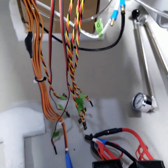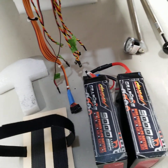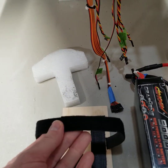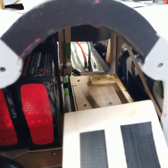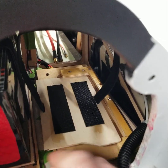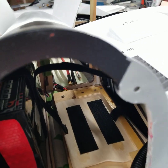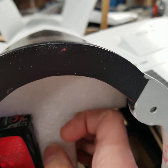In the tray system — a simple tray, aircraft-grade ply once again, with Velcro — your batteries get put onto the tray and stuck down, then you use your battery strap to lock them together. That tray simply goes into the fuselage. I've tried it over and over again — it sits down under the ledge, slides in, and then it locks. Once it's in there, I have a piece of foam that goes over top and sits between the battery sections and holds them down.